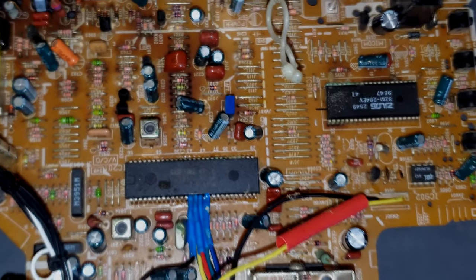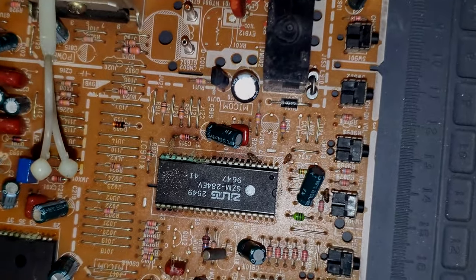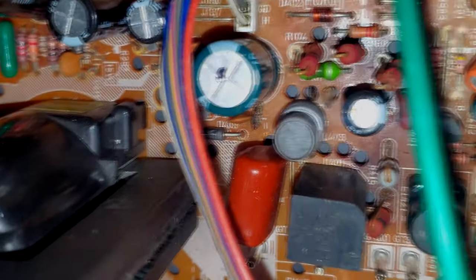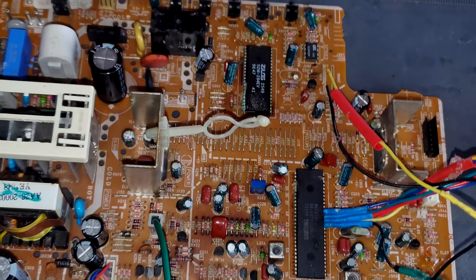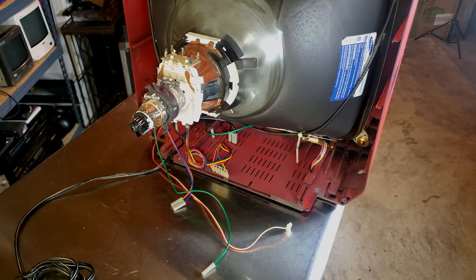I'm going to douse this with lots of rubbing alcohol and wear heavy-duty kitchen gloves because you don't want any of this - it causes bacteria and can get you really sick. I'm taking this outside to clean it up. There's another spot where all those resistors got peed on and have rusted up, so this is going to be a pretty tricky one. I just need to clean it effectively and gently. The rest of the chassis isn't as fragile - we can hose that off, use heavy-duty bathroom cleaners to kill the bacteria, and give it a day or two to dry out.